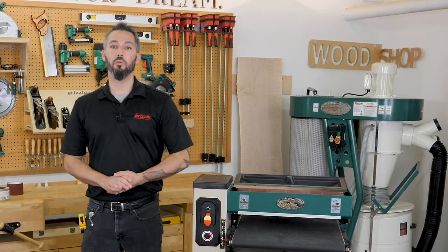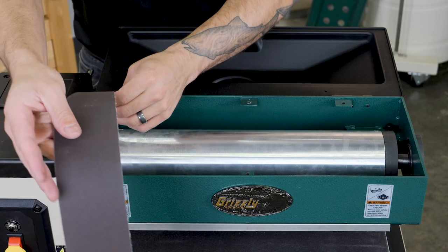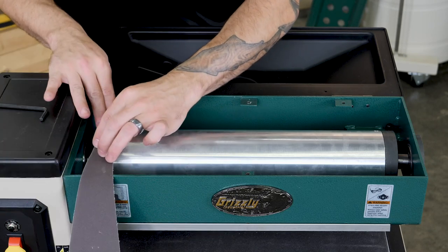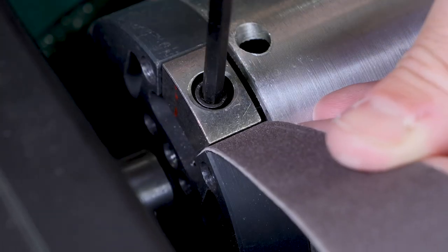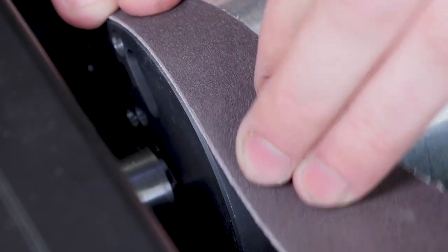With the new piece cut, we can start installing by securing the angle into the left clamp and tightening it. Ensure that the angled side of the sandpaper is flush with the left drum edge. If the sandpaper overlaps the edge, you may have difficulty closing the cover.